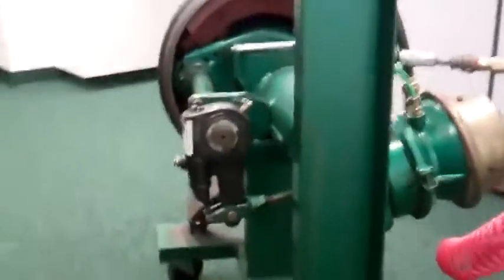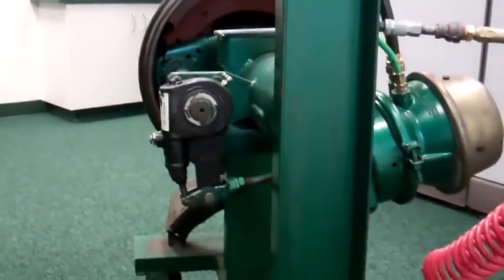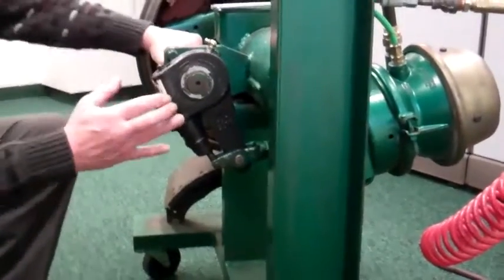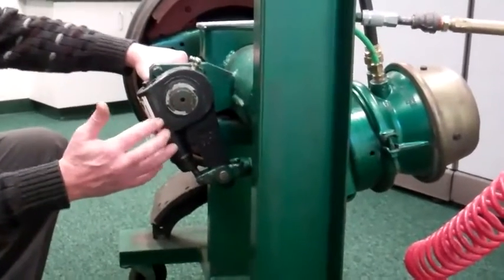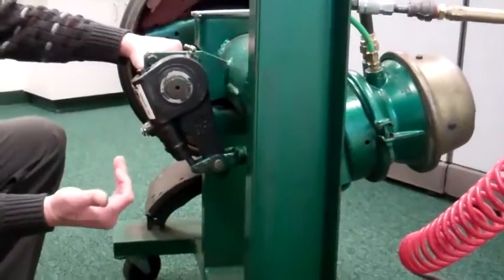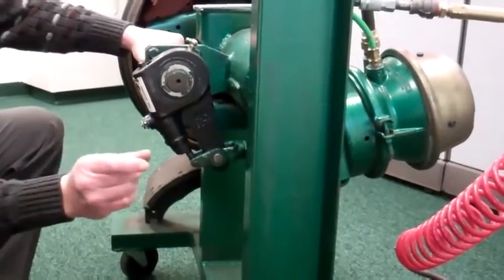To make the brake adjustment manually, the brakes have to be released. The brake slack adjusters are designed to automatically adjust upon brake de-application, and they are to maintain one inch of brake chamber rod travel.